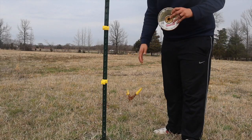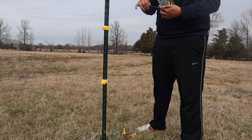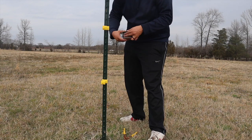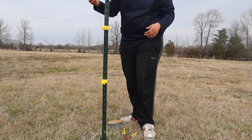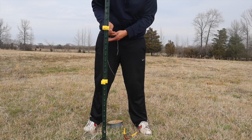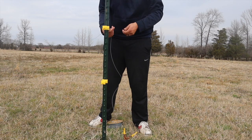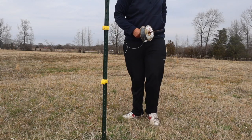So you guys can come with me and see how I build these fences. Remember, this is semi-temporary. It's not like a perimeter fence, this is just a bunch of cross fencing. So we don't need heavy high tensile 12 gauge wire to keep things out. It's just so the cows know not to go where not to go. So we just tie it on to the T-post here, and this has been working great. Then we get a long screwdriver, put that through the middle, and we walk.